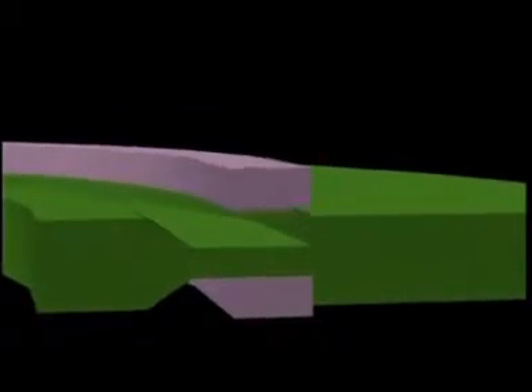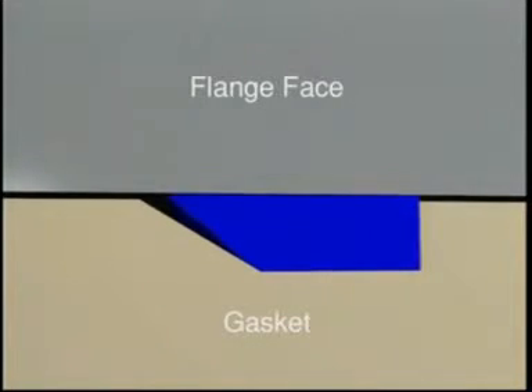The sealing concept of the Linebacker is based on a quad ring — a rectangular seal element positioned in a groove with a slight incline facing toward the pipe barrel. As the flange faces come together, the sealing element is compressed sideways, forcing it into the void area up the incline. By precisely controlling the void volume ratio, when firm contact is made between the gasket retainer and flange face, total encapsulation of the sealing element is achieved. Only micro exposure of the seals to any external or internal environment protects them from deterioration by both atmospheric conditions and internal media.